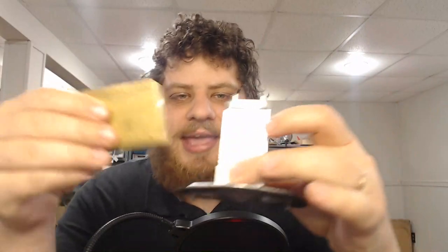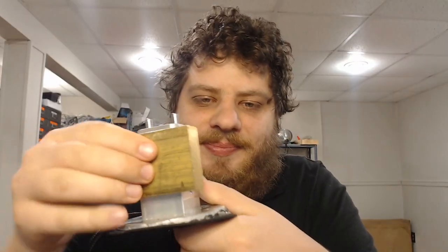I was delighted that part had been so easy to make. So I grabbed a chunk of brass I have sitting around, put the hat on, and clamped it down. That is when I learned it wouldn't clamp. No matter how hard I cranked down on that top screw, I just couldn't get it to bite onto the piece of brass. Turns out this brass is 15 thou undersized, and I had designed this to accommodate a piece of brass that was 10 thou undersized. Brass extrusion is supposed to be oversized, not undersized — but Mr. Murphy apparently fulfilled my order. I got some really good advice from quite a few of you on Instagram about how to solve the problem.